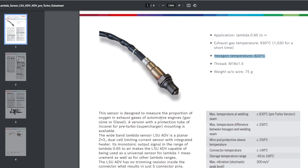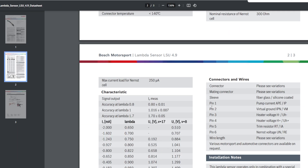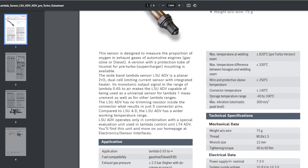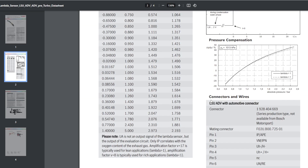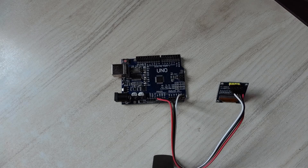That goes from a six-wire setup — you can see six pins in the data sheet, and pin number five is the trimming resistor. The controller has to do extra math to work out the trimming resistor value and adjust for accuracy. But if we look at the data sheet for the advanced sensor, pin number five is NC — no connection. They no longer need a trimming resistor because the sensor is highly accurate on its own.